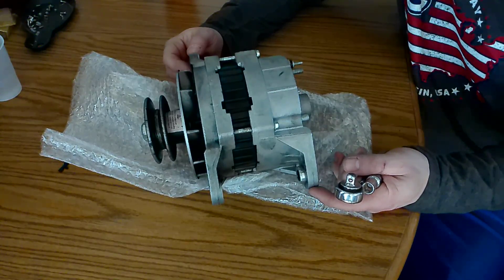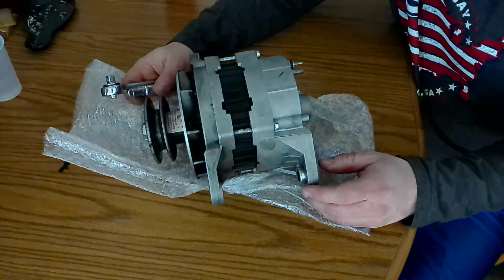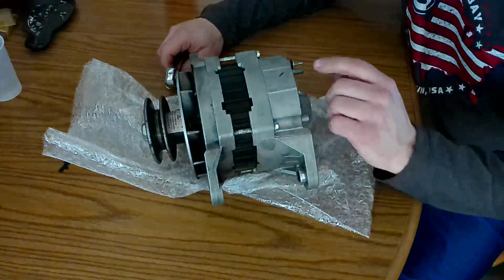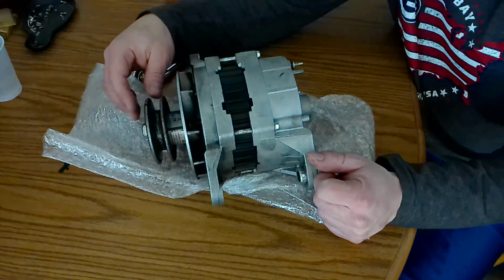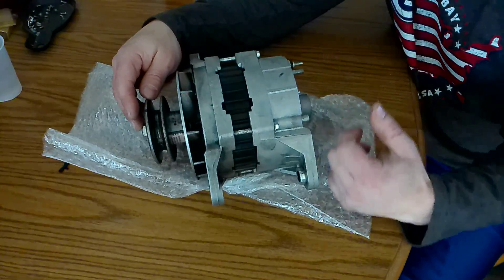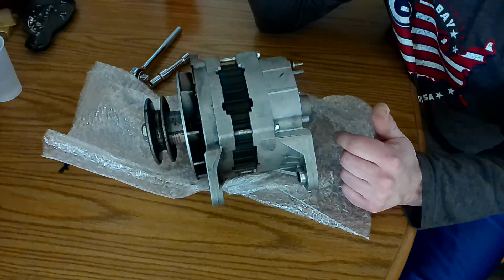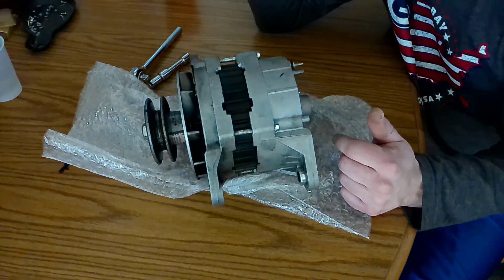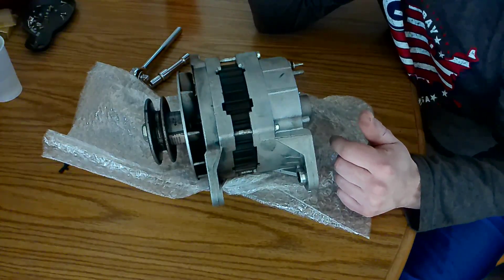We went probably two and a half days with no sun, so I went to go start the generator and noticed that when I flipped the main switch for engaging the main power back here, it didn't draw down the motor. There was absolutely zero difference whether it was engaged or not. So I got my Fluke and checked out the amperage on the output. It was putting about 13.5 volts out but only allowing 0.1 amperage through. So I knew something was up.